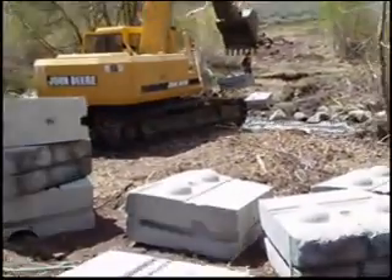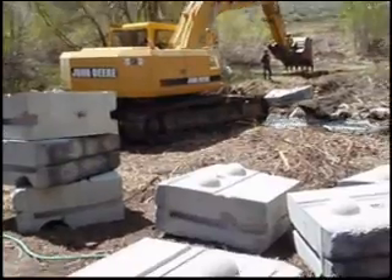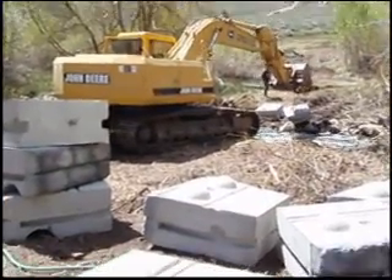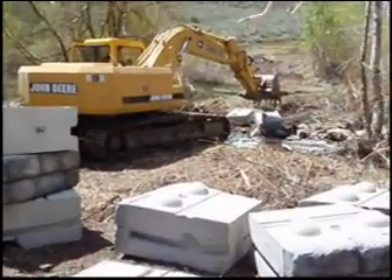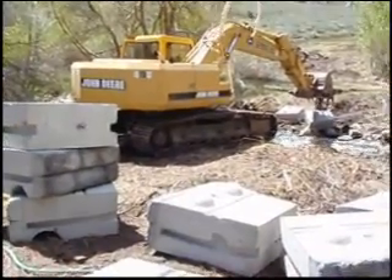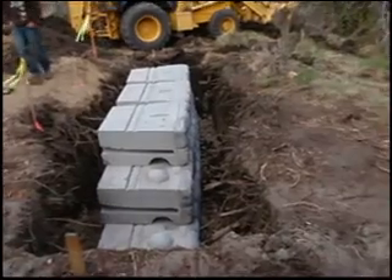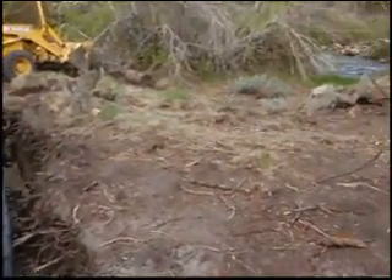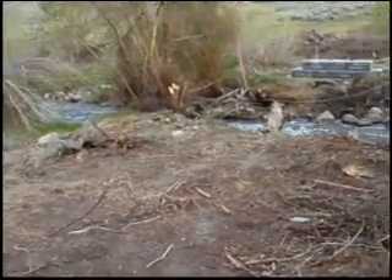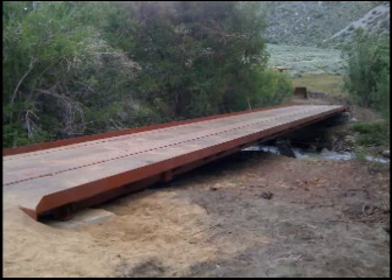This remote site had very poor access to the other side of the river. This is another advantage of using our precast blocks since we can simply reach across the river and stage blocks. Also notice one of the alternative block face types used here. This is a good example of our basic single wide abutment package rated for 80,000 pound vehicular traffic. And this is the finished product — 90 foot long and 10 foot wide.